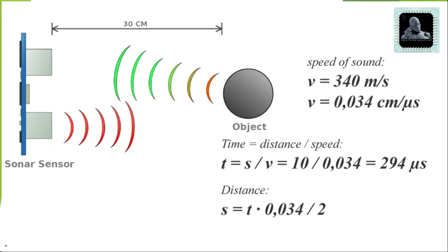Now let's understand the working principle of a sonar sensor. The sonar sensor emits an ultrasound at 40 kHz, which travels through the air, and if there is an object or obstacle in its path, it will bounce back to the module. Considering the travel time and speed of the sound, you can calculate the distance.